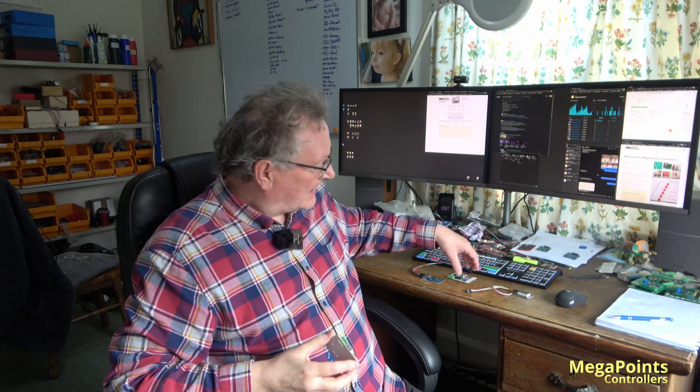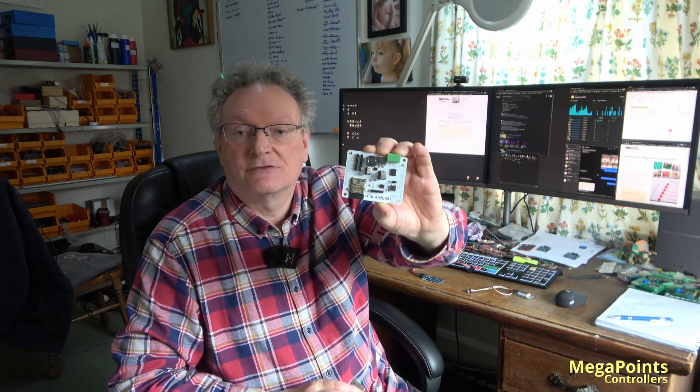Each of the boards comes complete — in this case four displays and four cables. The tag reader comes with two tag readers ready to go along with cables. The display board supports four channels or four v-ports; the reader board creates two, so to fully populate the display you would want two sets of RFID tag readers to read four tags.